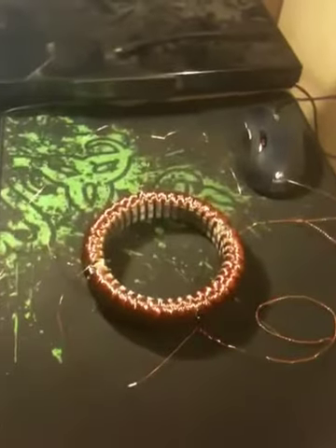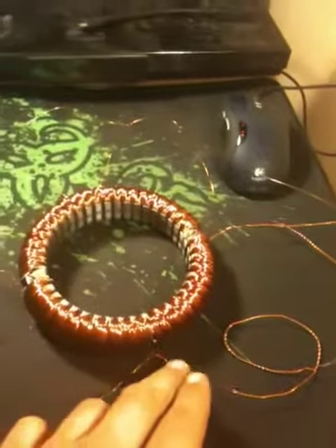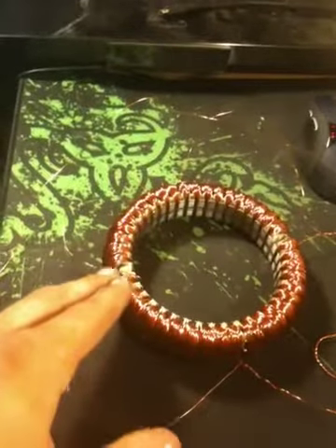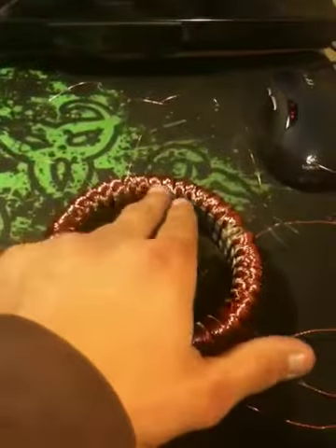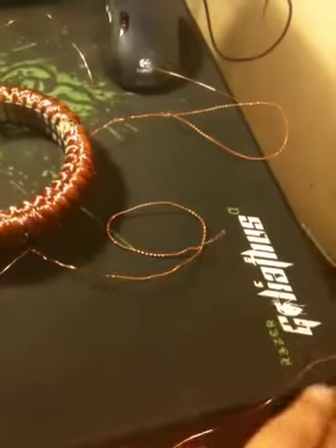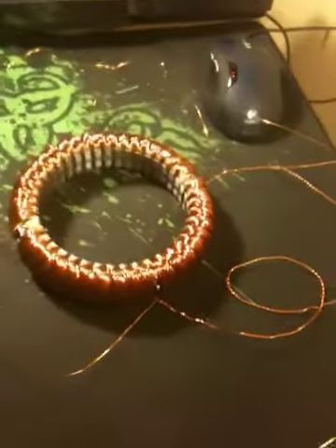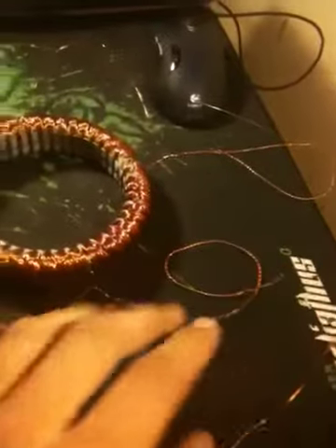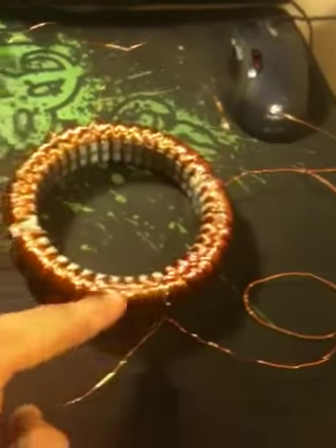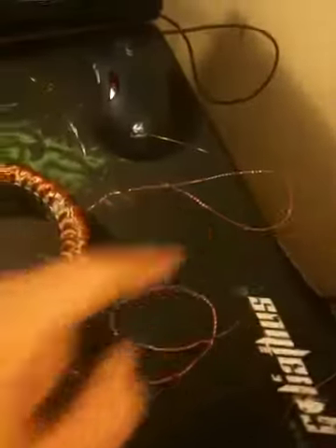I got the rotating magnetic field ring completed. It has two wires. Here's one end where I've wound a coil, then it comes out and I get another coil up top here, then it wraps around and comes back as the second lead that connects to the generator. It's going to be a two-phase alternating current generator with four slip rings. The other lead comes and makes another coil here, the end comes out and I make another coil here, and then it goes back into the generator.